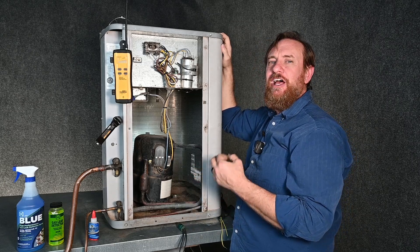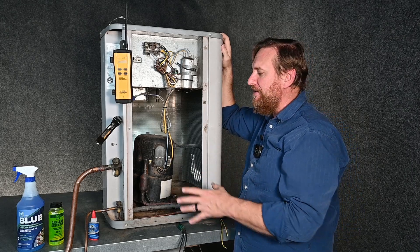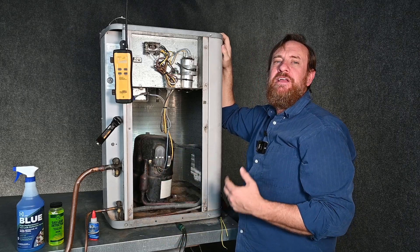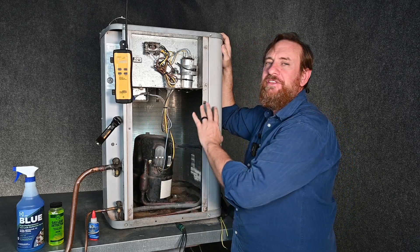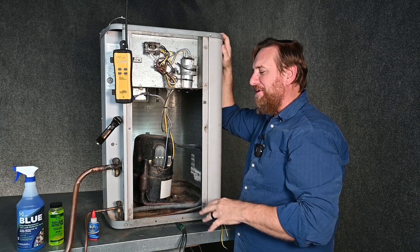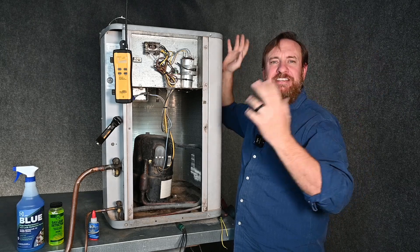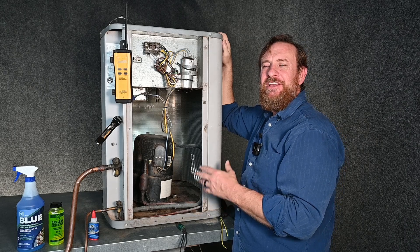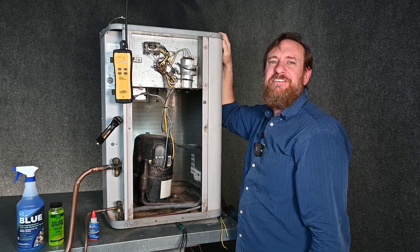So some little tricks you can do to help find those leaks a whole lot easier — and there's tons more. As you go through time, you'll figure out your own tricks and shortcuts, but these are the things I do. I start from the most likely places first and then go deeper and deeper. You can then pressurize it up with nitrogen separately and look for a leak in the condensing coil with that extra pressure. But make sure you take your time and shut the power off to the equipment before you do any other work. Follow all your OSHA safety guidelines — safety glasses, gloves, whatever it takes to be safe. Follow all safety recommendations first. Doing some of these steps will help you understand how to find those leaks, what caused those leaks, how to prevent those leaks, and help you make some money and hopefully save the customer some money.